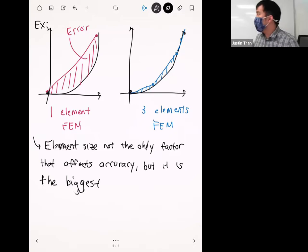And in fact, for a lot of the other factors of the mesh that affect accuracy, if you simply make your elements smaller, it actually solves a lot of those issues too, right? All right. And so, since we know that if you make the elements smaller you're going to end up with a better quality solution, the fair question to ask, and quite a few people have already asked me this throughout the activities, is: why don't you just make the elements really, really, really small, right? Why don't we just basically kill the thing with elements and make them all microscopic size, okay?